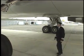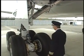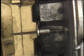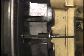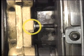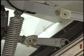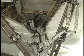Next, look at the main landing gear. Check the wheels and tires for any damage or excessive wear. Look at the length remaining on the brake wear indicator pins for each wheel — remember the parking brake must be set when checking the wear indicators. If any indicator pins are flush with the brake flange, notify maintenance. On the shock strut, at least two inches of polished area should be visible, indicating proper extension. Look for signs of excessive fluid leakage. Make sure the gear lock pins and streamers are removed, and the main gear hydraulic actuator shows no signs of leaks.